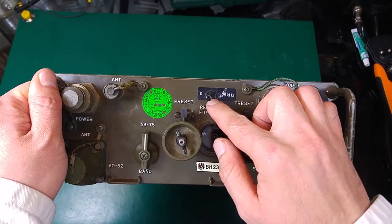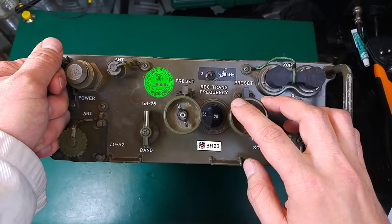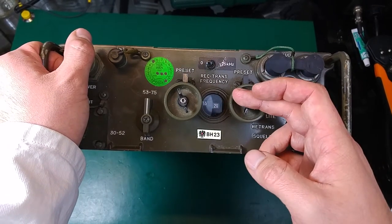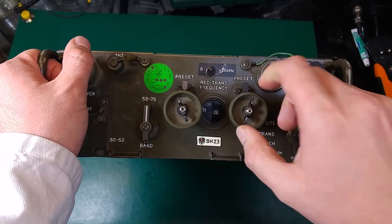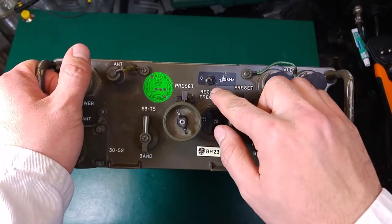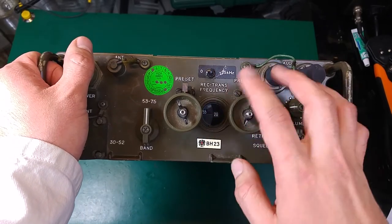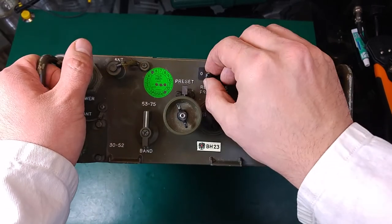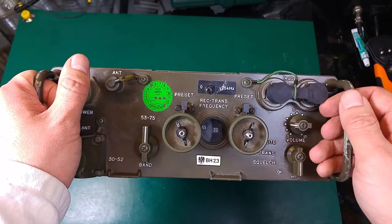And over here we've got something that was not manufactured by the company who was making them. That was an upgrade, because that radio was originally operating on a 50 kilohertz step, which is a frequency raster. That doesn't mean the bandwidth. That step doesn't mean that this is the bandwidth that the radio is taking. This is just the frequency channel spacing. So they made an upgrade, because that radio has, I think, 920 channels in the 50 kilohertz span on our two ranges, and we can clearly see that if we add a 25 kilohertz spacing, we just double the possible channels.